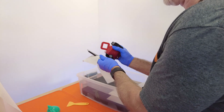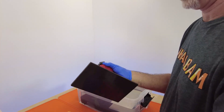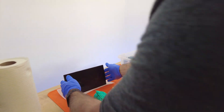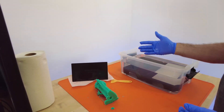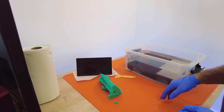So we'll just drip that dry and give it a quick dry wipe. You may want to just let it sit out on some paper towel for a while. We don't want to put the flexi plate back on until this is completely dry, because trapped alcohol between the flexi plate and the magnet can eventually erode the coating of the magnet.